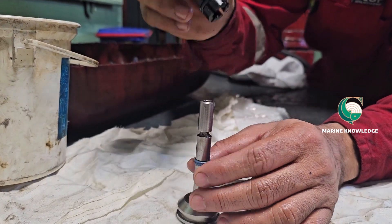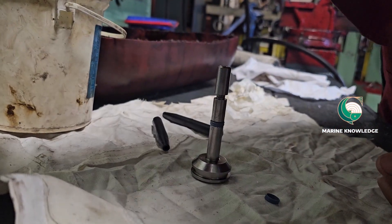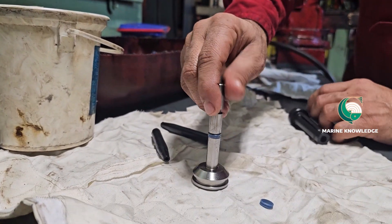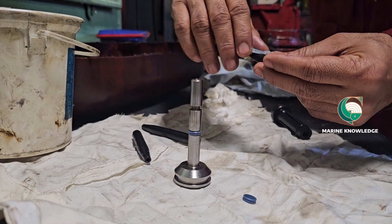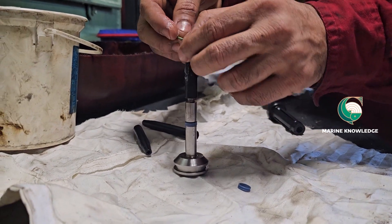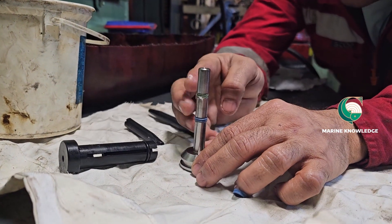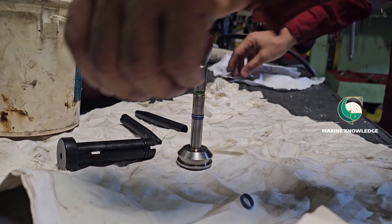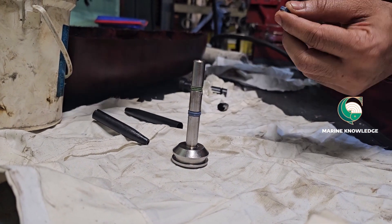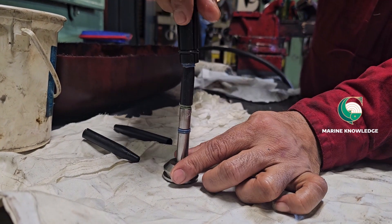The same way you have to fix the top groove as well, and for that you have to use a different tool. Apply some vaseline, use both O-rings, the O-ring pushing tool and push — but the key thing is you have to use the proper tool, as I always say. There are two different sizes of pushing tool for this puncture valve air piston. Next comes the seal ring — be very careful. Apply vaseline, fit the seal ring, and push with the help of the pushing tool.